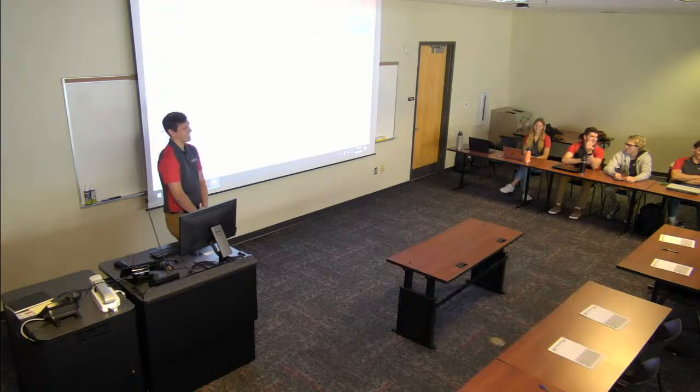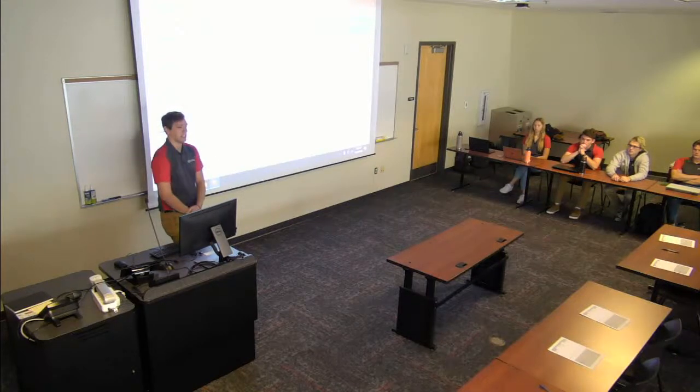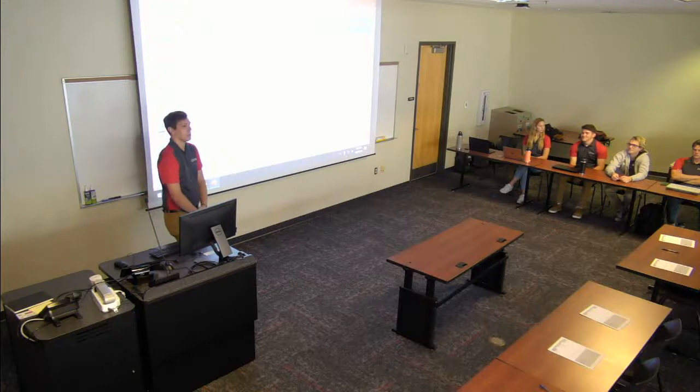We're in the middle of testing a different design right now. I can comment on that. The whole process of building the transition and nose cone molds takes a good while, so there should be ample time for them to finish their nose cone analysis. In that time, we can work on the transition and the other parts. When we finally need the finalized shape is kind of the last step of making the plug for the molds, so that's something we can push off to the end.